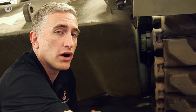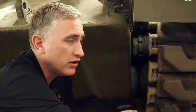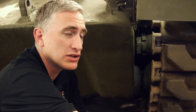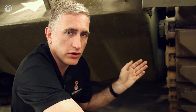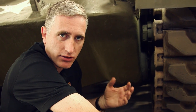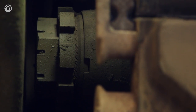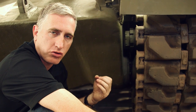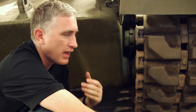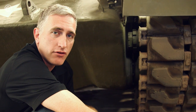This bolt up here is part of the tensioning process. To access the tensioning mechanism you have to lift up the fender, which is hinged. In theory it should also be bolted down — I can only imagine in the field how many times people didn't bother putting the bolt back. Once you've undone the locking nut, you take a really large wrench and a couple of lads and lever the thing up or down to move the idler forwards or backwards, which tensions your track. There are little serrations — triangular teeth — that keep the tensioning arm in place, and the locking nut forces the idler adjustment bolt to the arm. It's simply a matter of brute force and time.